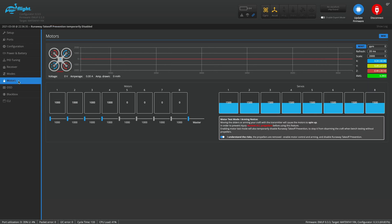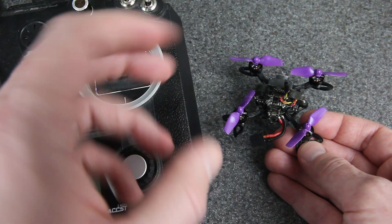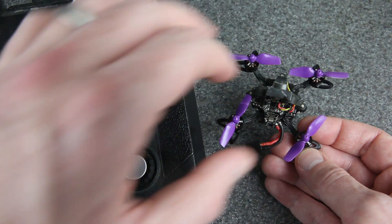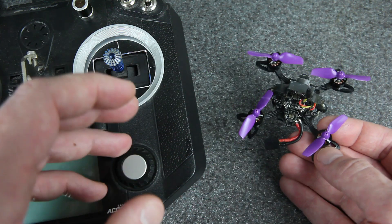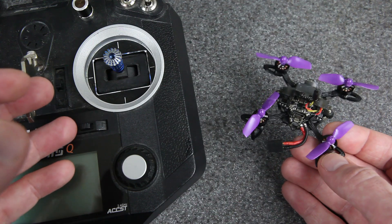Then it's a good idea to come back to the motors tab. If you have a battery connected, you can flip the switch right here — it's a good idea to have props off. Then you can spin the motors one at a time to make sure each one is spinning in the correct direction according to the diagram, and that the correct numbered motor is firing. If all of that is good and the props are on the right way, you should be good to go. If your build has a different flight controller or it's mounted differently, you might need different motor directions or resource numbers, but the techniques apply the same no matter what you build.